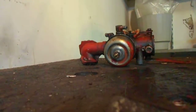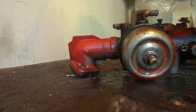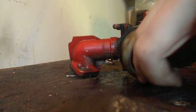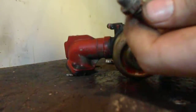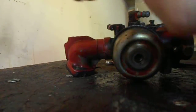Today we're going to clean this carburetor. All you're really going to need is a half inch box-end wrench or socket and wrench. I've already loosened this because it's really tight, so I'm just going to take this off. What you have here is a little sealing washer and your bowl nut.